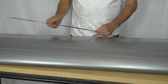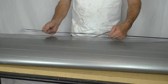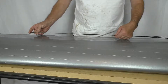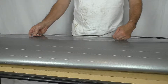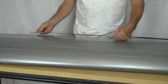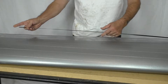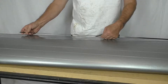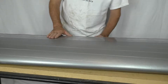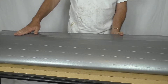The other thing I'm going to be doing today is a layup that leaves one end of these rods free for flexing. If you go look at the other segment about the wing joiner spar cap combination, you'll see why it's essential to have the end of these rods free to bend back. So I'm going to be packaging these up where they're bonded together halfway down their length and leave the other end open for flexing. I've prepared the mold with a layer of packing tape on top that provides my mold release.